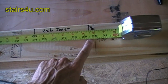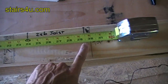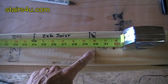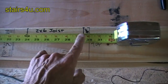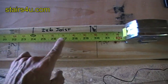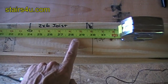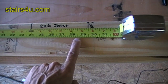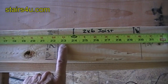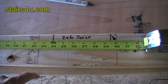On top of the joists will be a half-inch decking material. Now if I was going to use inch-and-a-half decking — say two-by-six for a deck — I would subtract an inch and a half instead of a half inch, then subtract my two-by-six. Subtracting an inch and a half puts me at 28 inches, and then subtracting another five and a half inches gives me a 23-inch wall.